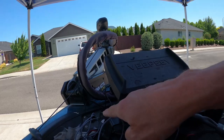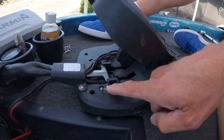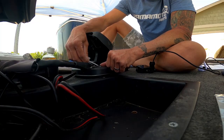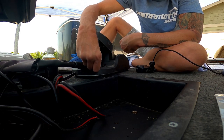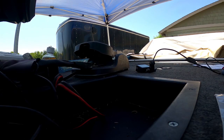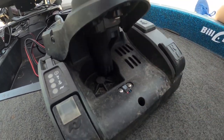First thing I did was disconnect the power. By turning the motor, I can get the pedal to actuate still. You have one sensor right here, and we need to undo those screws. We're going to pop that limit sensor out of there, just use the slack we have in that wire to fit it back down in the base. Since my motor's deployed, I was able to spin the motor all the way by hand, and now I can get to this other sensor.